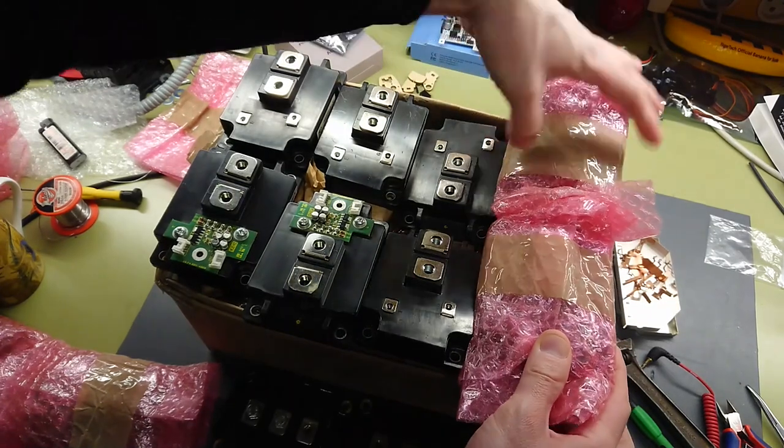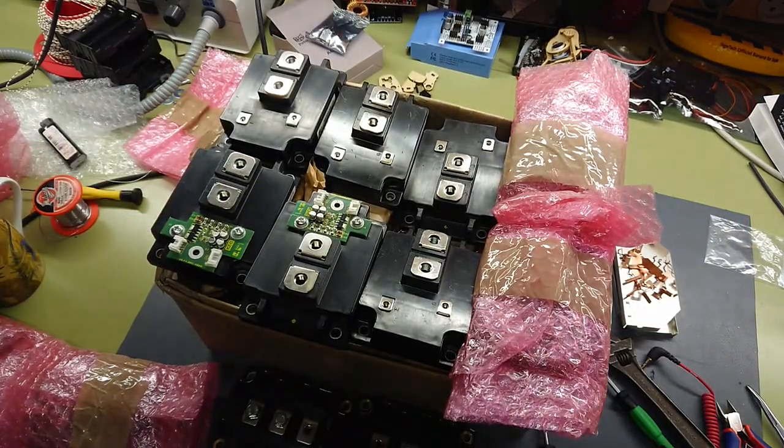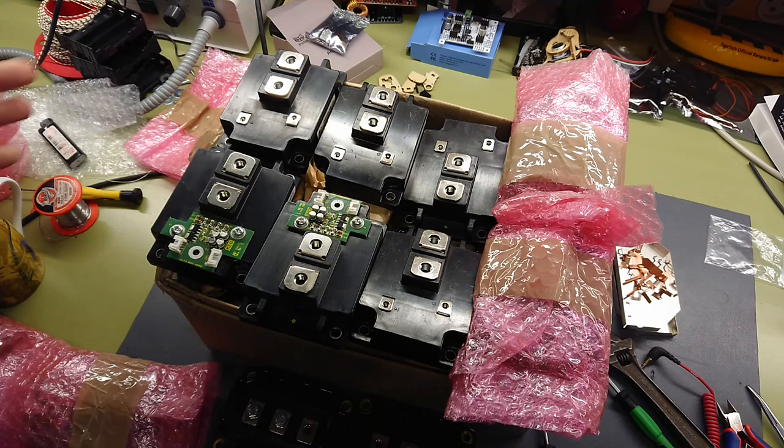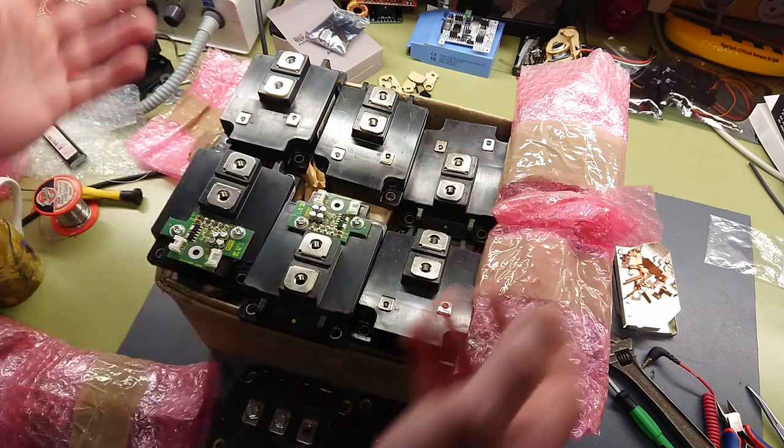And then two more out here. That's a good size — a piece of A4 paper just covered in bricks. So that's at least the minimum I'm going for with this next Tesla coil build, and that should probably push up around some three or four thousand amp primary current.